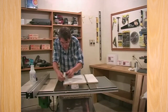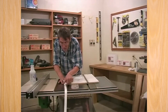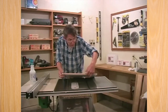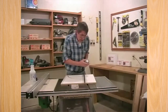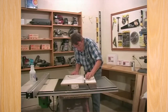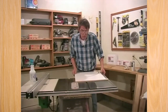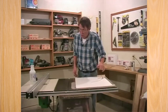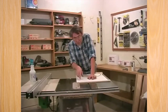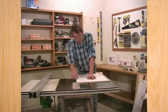Now applying the one on the outside edge. Before I flip this over and start to use it, I want to make sure I've got all these rolled in nice and tight, and I'm going to hit those strips with a little of that dry lube too. I'll flip it over, put the bar in the slot, and check to see how it moves — it slides like it's on bearings. There's a little bit of dirt on the top I want to clean off. Now that we've got everything set up, my blade is elevated and set up square to the table top. We're going to turn on the saw, run this through, and cut the edge off.